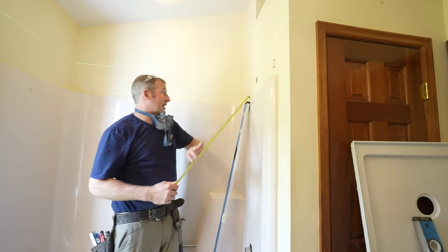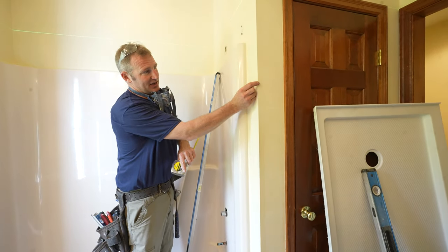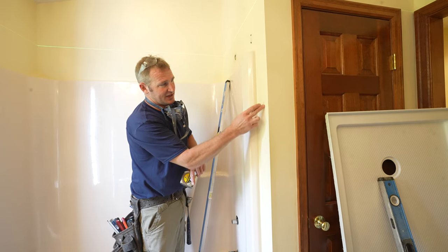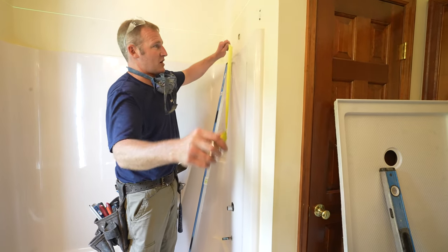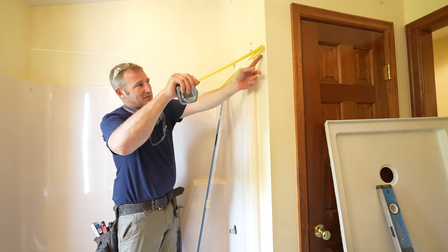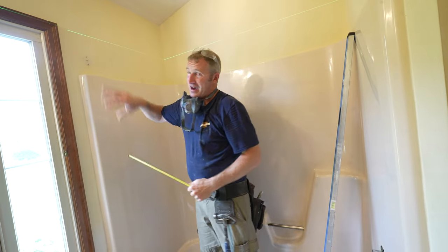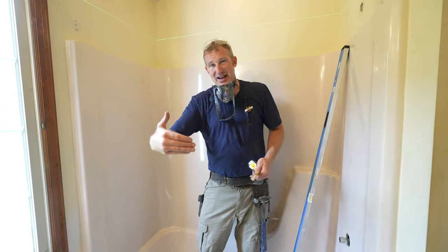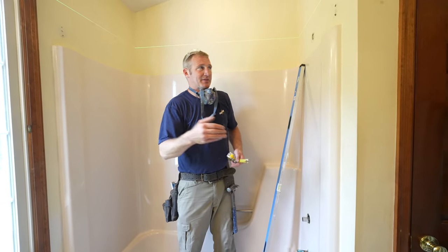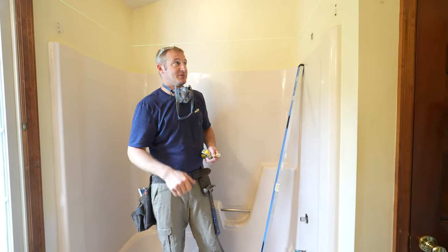One thing I really want to keep an eye on is this outside corner, so I don't have to do a whole bunch of additional work. I want to stay away from the edge where my corner bead is, because if you hit that you end up cracking some of this off. So I'm going to stay inside of one inch, and my shower pan is going to be 32 inches — so once I cut this out, I'll come out about 33 inches, about two inches away from the edge of my outside wall. I always recommend having the tile work come outside of the shower base and go down along the edge, because it's a real common area for water damage. When you're cutting this out, just be sure you're going outside of that flange — that's the most important part.